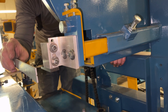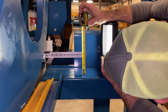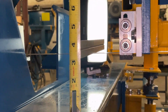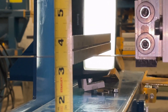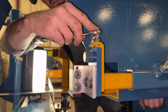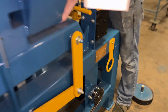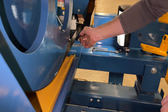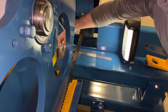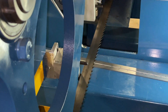After you make that adjustment, put your straight edge back up and check it again. Now in the front we are at four and a quarter, and in the back we are right at four and a sixteenth still — so we need to adjust the front just a little bit more. Take the pressure off the back, tighten up the front. We are no longer touching on the bottom of our blade, so draw the block back down, loosen up the L-bracket, and find our distance like we did in the beginning.